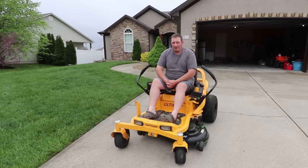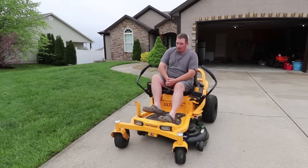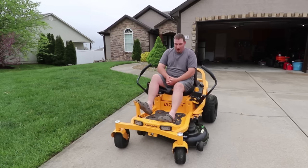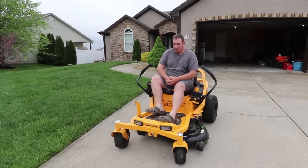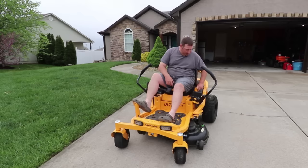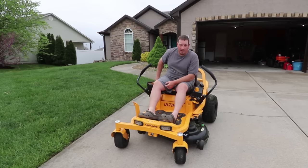Leveling the deck is very easy and adjustable. Pulling this deck off is very easy; putting it back on you can do it with just one person — pretty well thought out. But if you plan on loading this up on a trailer and this deck hits anything, you're more than likely going to have to figure out if you bent the stamped deck, or if your deck went unlevel — which more than likely it did. The one thing I wish they had is something that held this deck up in the full position; you could pull a pin and drop the deck to your three and a half every time you go to cut. This deck only goes as high as four and a half inches, guys.